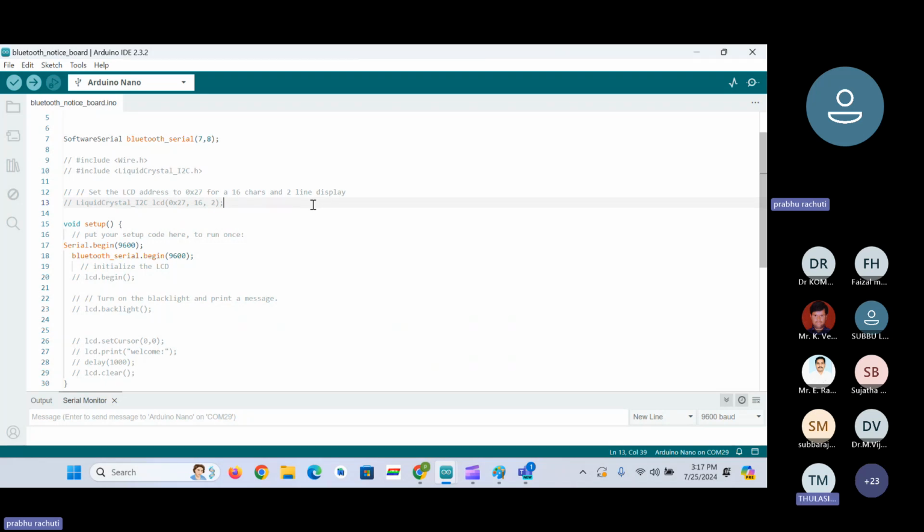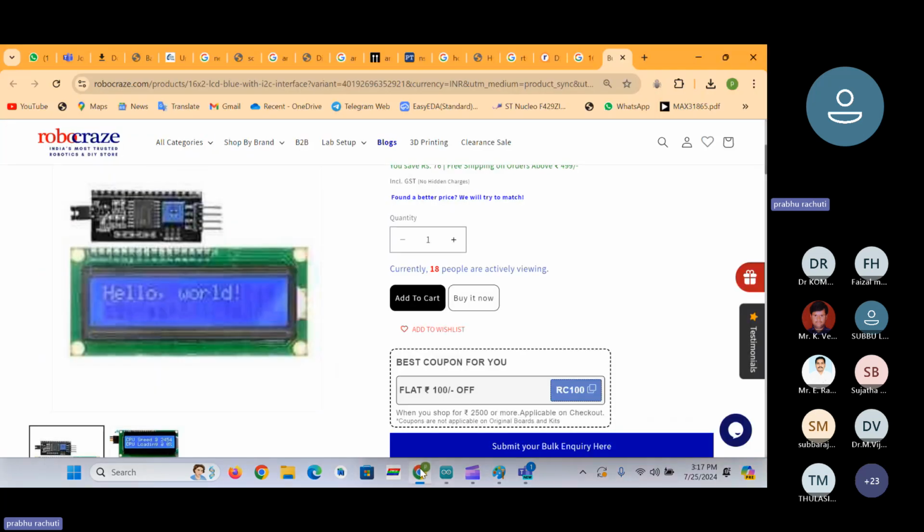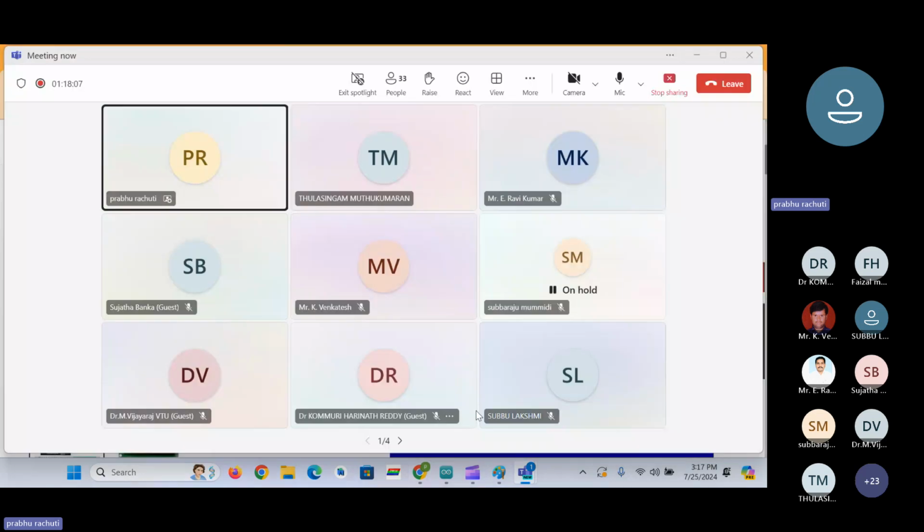And one more thing, some embedded boards won't connect to the hotspot that is enabled by the iPhone. iPhones have a different structure and different frequency in the hotspot, so there might be a chance you won't connect to your hotspot network. So please prefer an Android phone while working with embedded boards. Please check these points and let me know again.